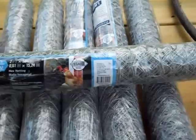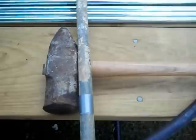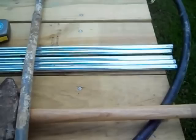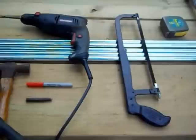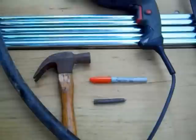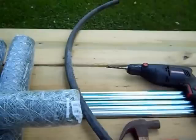The bill of materials I'm using today: a piece of pipe with four inches marked off with duct tape that I'll drive into the ground to make the hole with the sledgehammer; five pieces of half-inch galvanized conduit cut into 40-inch lengths. You'll need a tape measure, a hacksaw, a drill with about a quarter-inch bit, a hammer, and a punch to start your hole or the bit will wander all over the place. About 75 inches of plastic three-quarter to one-inch water pipe to put in the hole so I don't have to keep redoing holes and can pull the post up and move it. And some zip ties for attachment — all left over from a deer fence.